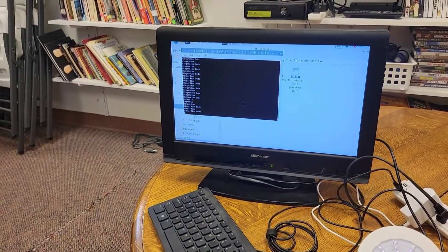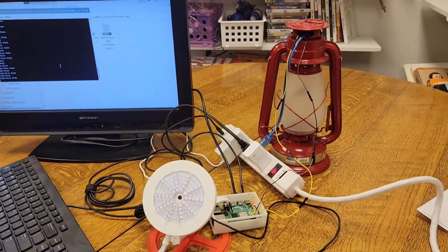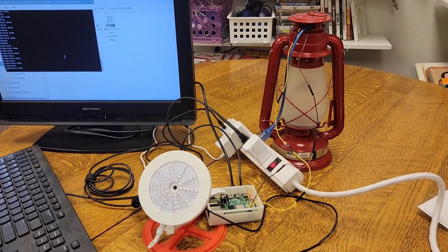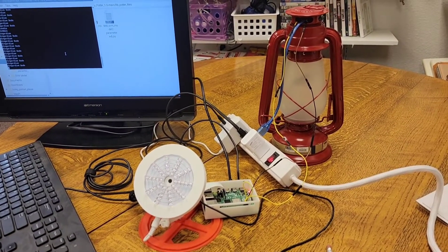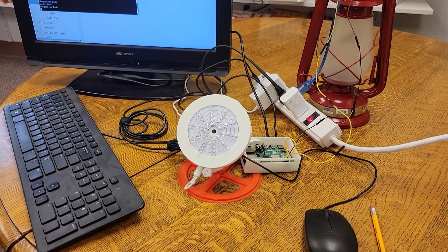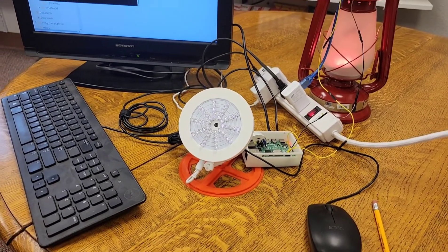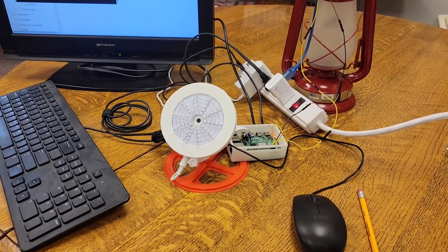That's all based on the programming. Right here we have our typical computer layout and you can see that we are running a script to run the lamp. This can be power heavy, so the consumption of power can be strong. The Raspberry Pi requires about 5 volts with a 2.5 amp current. This design for the lights requires 12 volts, 1 amp power supply. We then have the microcontroller, and the other one is the TV which requires whatever the TV requires. So right now we've got four items plugged into one outlet.